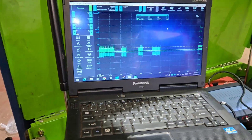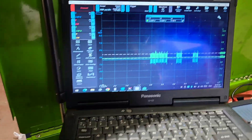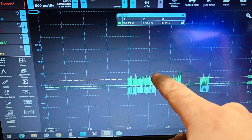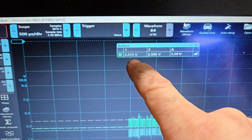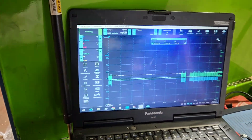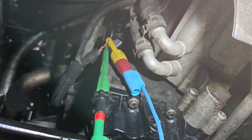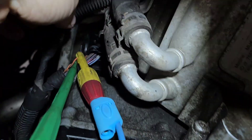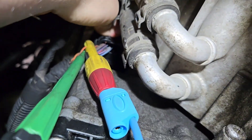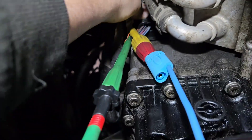Looking at my network — I've got my cursors over CAN high. You can see 2.5 to 3.5 volts, so the scaling is good right now. You can see the network there while it's running. What I'm going to do now is slide the connector home while the scope is running — sliding this connector tab on to make connection with the mechatronic.